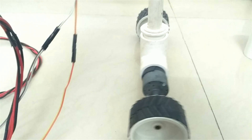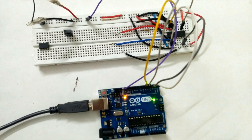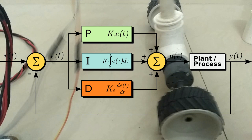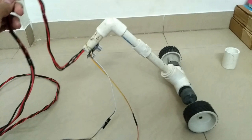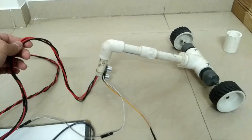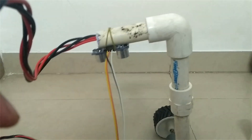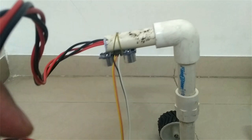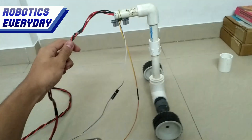These motors require a lot more power to be fast and responsive. And while testing, the second H-bridge of the L293D got fried, so I didn't get the chance to control it via PID. To truly make it balanced, we could have used the MPU6050, the Inertial Measurement Unit. Instead, we used this cheap ultrasonic sensor. But somehow we managed to make it balanced a little bit. We are happy with the results.